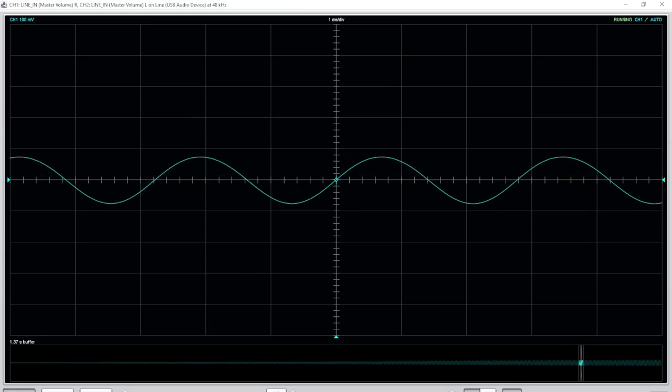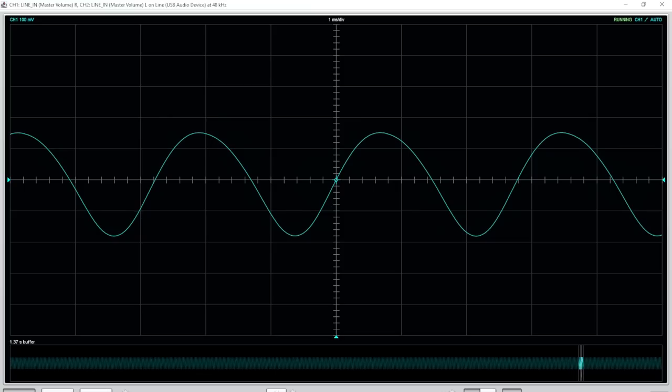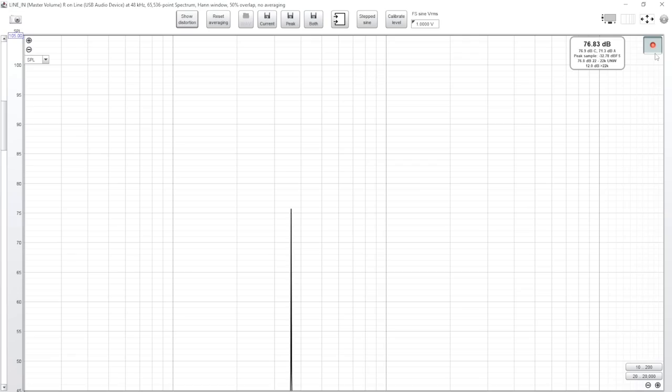And the 360, not quite as loud, not quite as symmetrical top and bottom of the sine wave, but it doesn't deform horrendously, so it's gonna sound fine. The fundamental is still kind of on its own, and the second harmonic does come up a fair height, but only really once we get up to a high level. So yeah, really clean across the board, this box. I gotta say, it is looking relatively promising for this little guy.